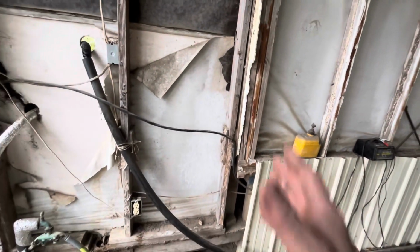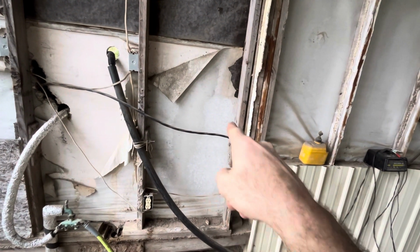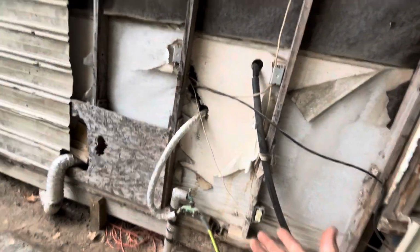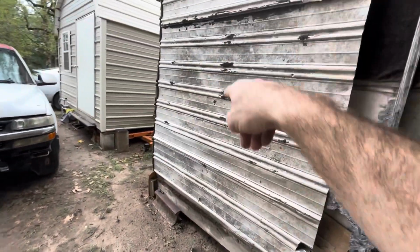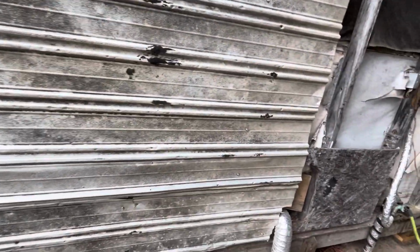I don't know. You see this right here? Splice 2 pieces of wood. Don't do that. If you don't have enough wood, go buy wood. 1 solid piece. Because that will fail right there eventually. It may not fail immediately, but a few years later it will fail. And it don't help that this is out in the weather right here. But when it rains, this never gets wet right here. That's what got wet, because it's out from underneath this thing here, underneath the roof.